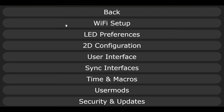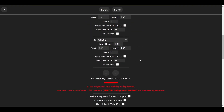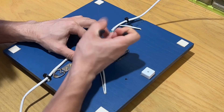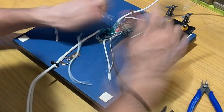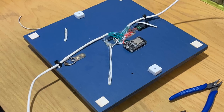After programming the ESP8266 with the WLED firmware, I realized at this point that I wasn't able to use this microcontroller because there wasn't enough storage. So I had to switch it out and put in an ESP32 which had much more storage for these LEDs. And with that final swap out complete, I was done.